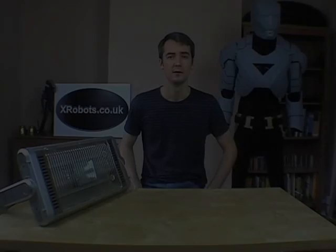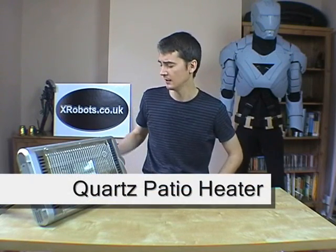Lots of the questions are about the heater, which I'm going to answer in this video. So I've got the heater here. As I said in the previous video, this is a quartz patio heater rated at 2 kilowatts. Obviously it's in the UK where the mains electricity is 240 volts. Somebody pointed out that in the US it's only 110 volts at 15 amps, which gives you about 1,650 watts as the most you can get from an outlet, so you'd have to make do with a smaller heater, or possibly use two heaters plugged into two outlets.